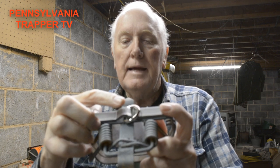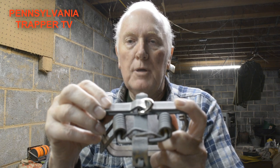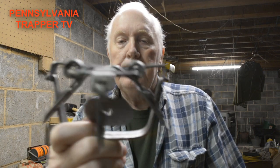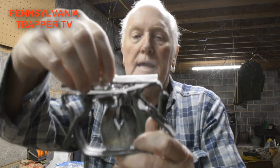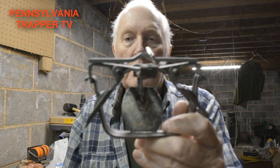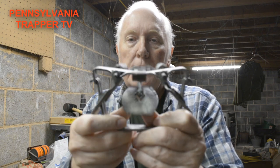The other modification will be across the base — we're going to put a base plate on that gives me a center support or attachment point for my chain. These will be drilled and bolted on. This base plate has a big bow in it, so I'll use my press to press that out before fastening the base plate on to help strengthen it.